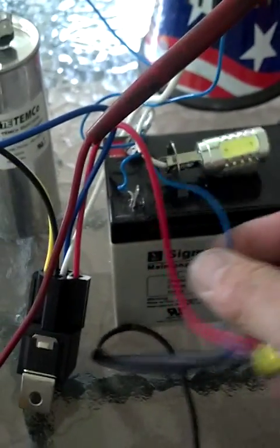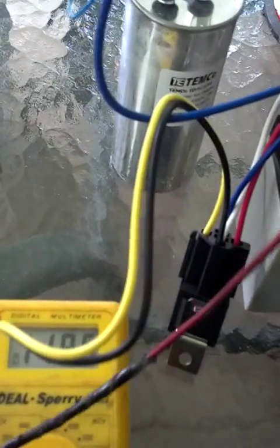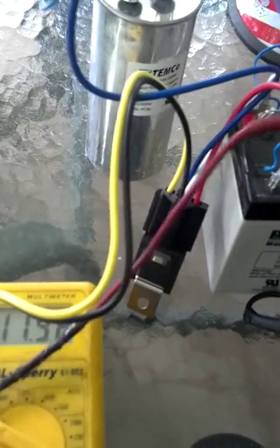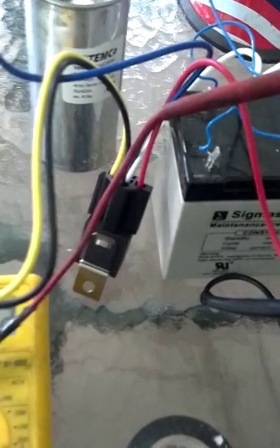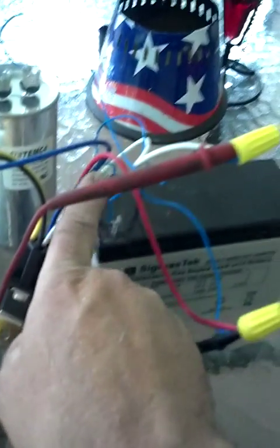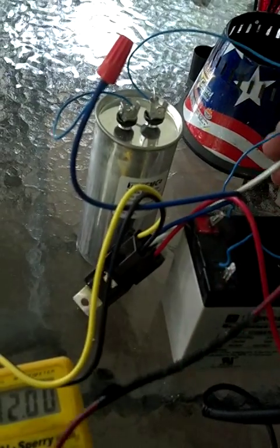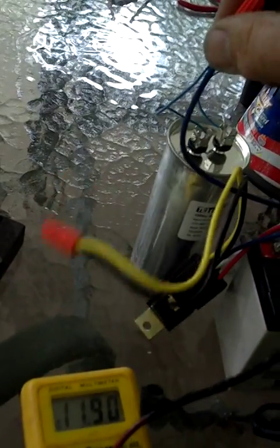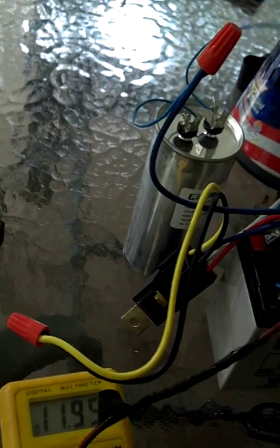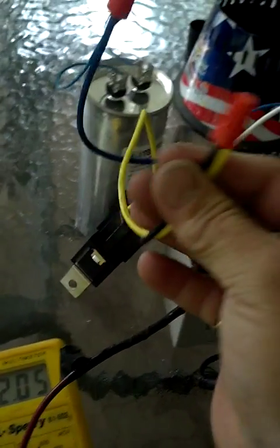Here's the battery, and this is the light bulb — I kind of mickey-moused it just to hang in there to see if it would run. It runs for hours and hours and the battery does not die. I have my meter probes, wiring from the battery to the meter probe, out of that into the relay pack — that's the red wire — out of the relay pack into the meter probe connecting to the other terminal of the battery. A blue wire is connected to one side of the cap, and a blue wire from that side of the cap goes back to the battery terminal. Two contacts of the relay are connected together. There is nothing else on the circuit.